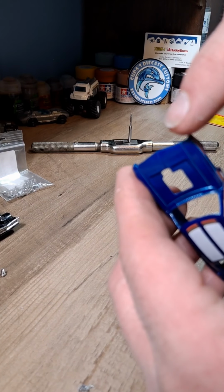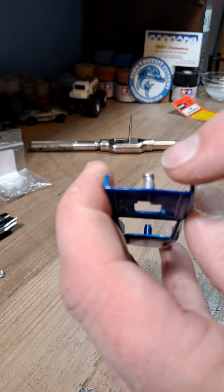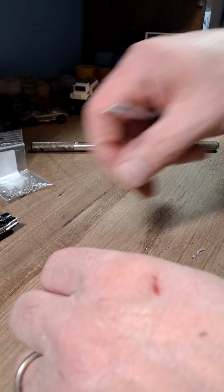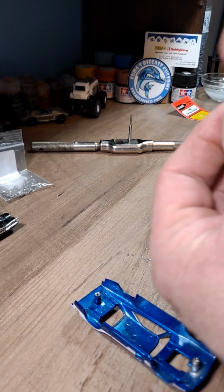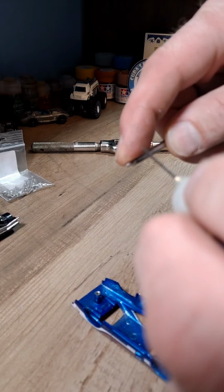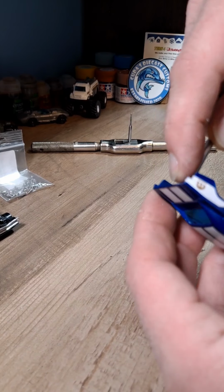You got to be really careful when you drill, because you don't have a lot of space in there before boop, you come out the hood or the trunk. So you got to be careful. What I've tried to do, and I haven't found the right way to do it yet, is to mark the drill bit with some kind of a tape. That's what we used to do in automotive, is put a piece of tape on the drill bit. Again, it's much larger stuff, so it's easier. Put some kind of indicator on the drill bit so you know where to stop, so you don't drill in too deep.